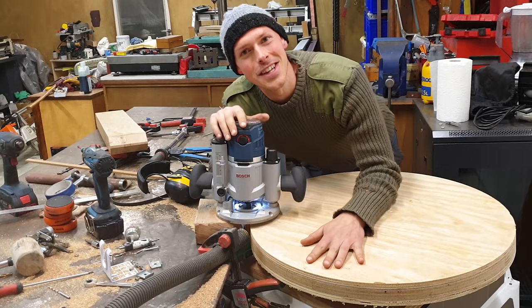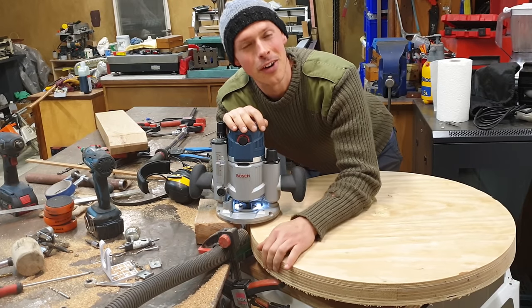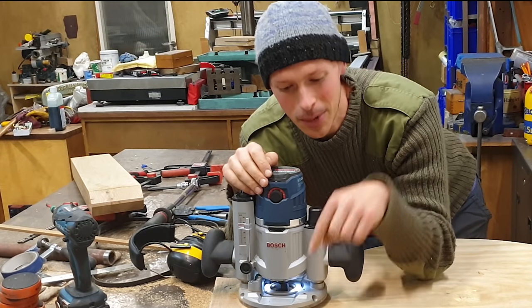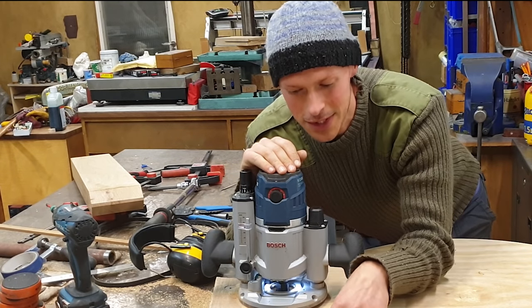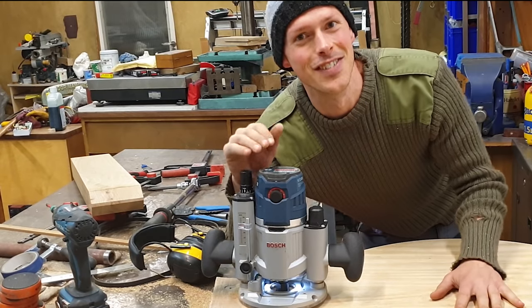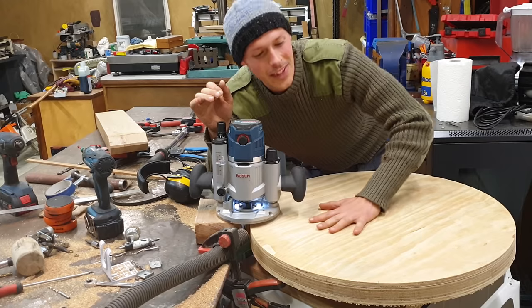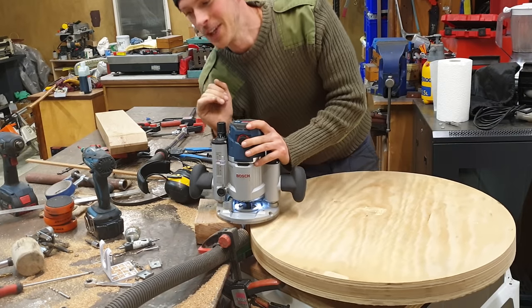So straight away, there's a few things I would have done differently there. Having a sharp router bit definitely would have helped. The nibbling down from the top, the method I settled on in the end, was much better than trying to push the things together from the side. Yay, it worked okay. Right, for now I'm off to bed. I'm completely knackered.